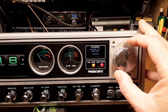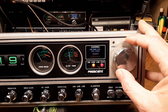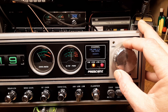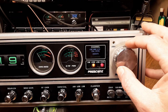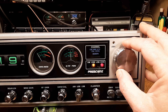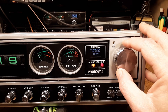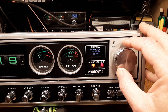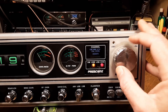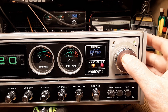The first menu item is number one. Number two is the Roger Beep — I'm not going to get into that right now. This is actually like the third or fourth board I've worked with. This particular board only needs the crystal frequency shifted by 79 hertz. The last ones I did had to be shifted by 3300 to 3400 to set them on frequency. That sets the reference oscillator where it needs to be, which for channel 20 would be 35005 for the VCO.